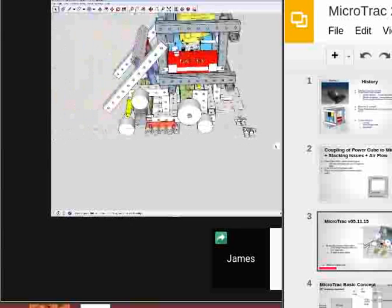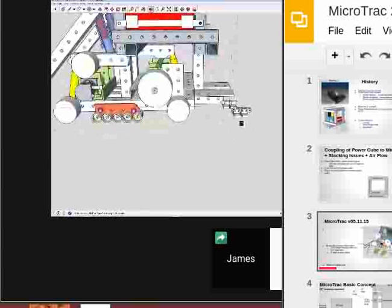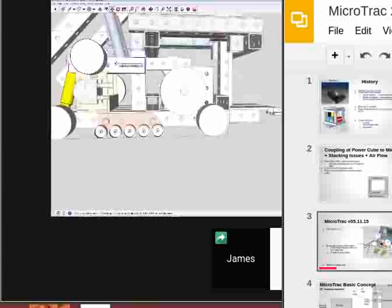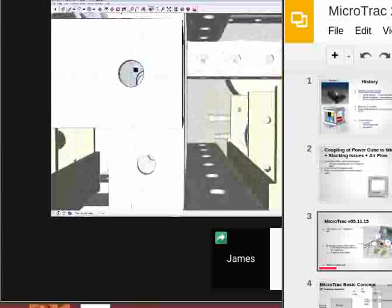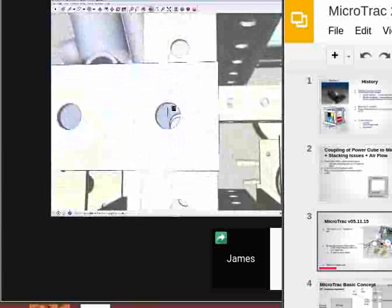So do track piece 4 inch by 6 inch, about, and then enlarge the idler to match. It'll probably be determined totally by the idler size. We have to match it to the idler. Yeah, we probably have to increase the idlers to avoid those tight angles, to match the track.